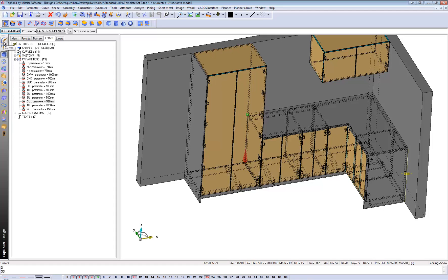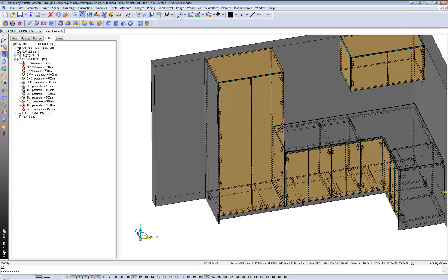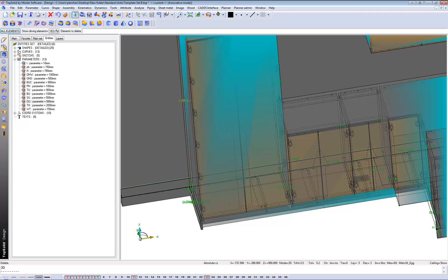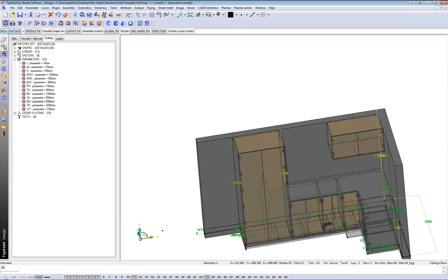Let's make that change now. Click on my unit and bring in 18 mils - whatever T is, the thickness. Now it's going to pull it back in. Let's press OK. Now we've got to create another end panel here, so let's just turn on our invisible lines and click on this here, and let's bring it up to the very top of this panel. There we have it.